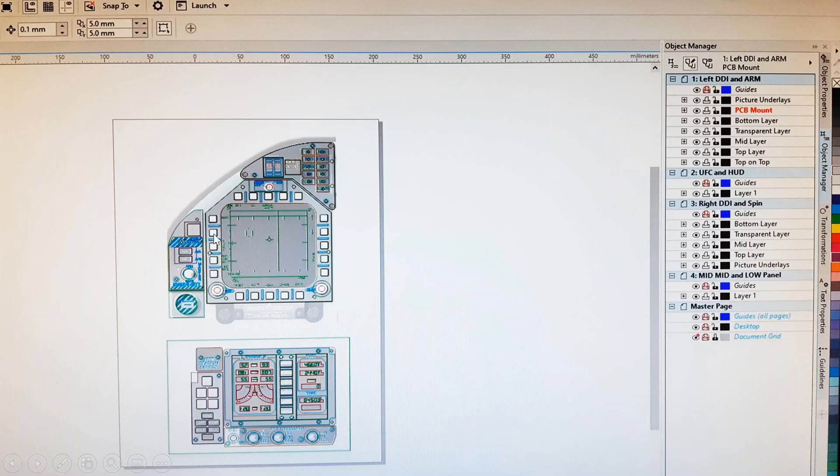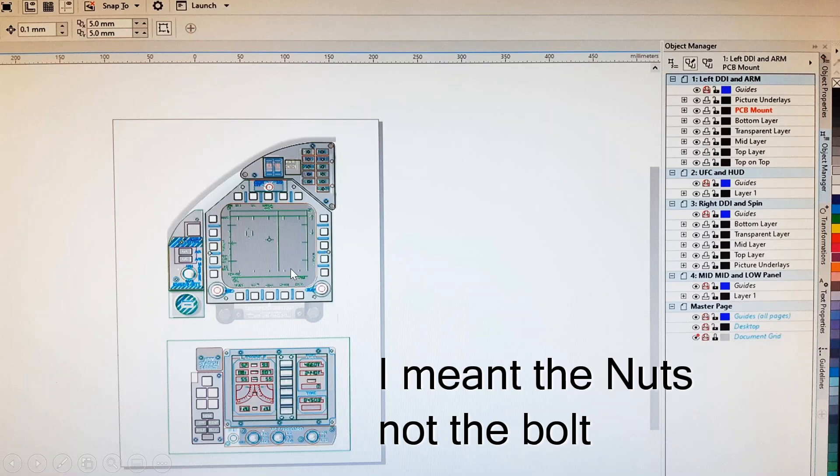The transparent layer is a clear acrylic layer which I later paint in dark transparent green using marker pen ink — it's very adhesive and good for the green tint, dark but still lets light shine through from behind. The last, bottom layer I first paint with opaque olive green, then engrave with the laser to expose the clear acrylic, creating the radar screen pattern. When placed behind the green transparent layer with an LED strip behind it, the markings shine through beautifully.